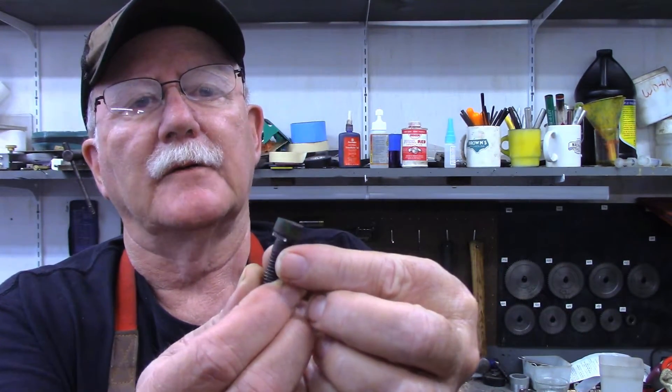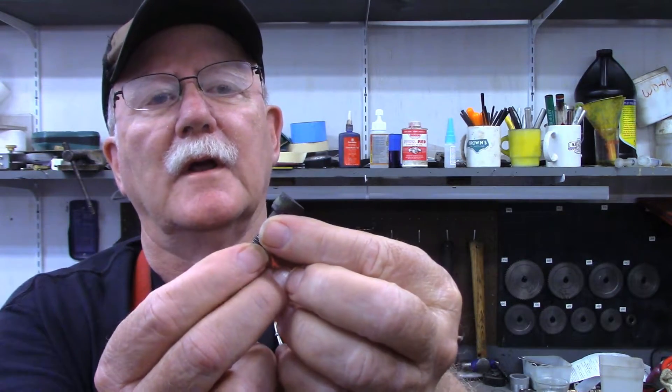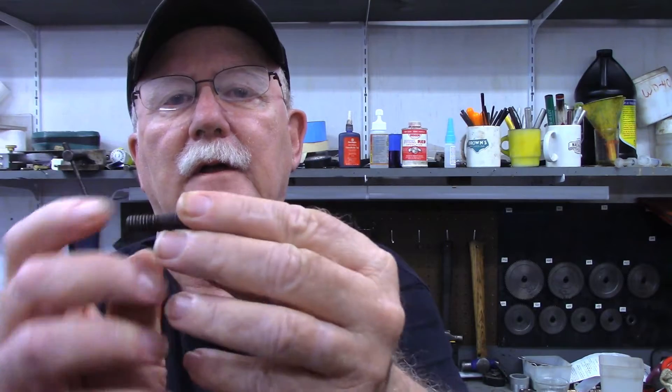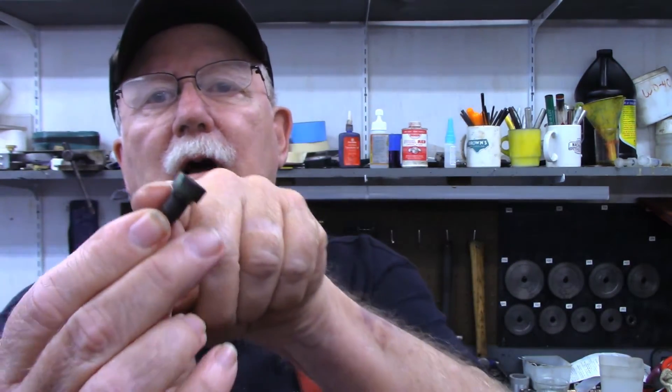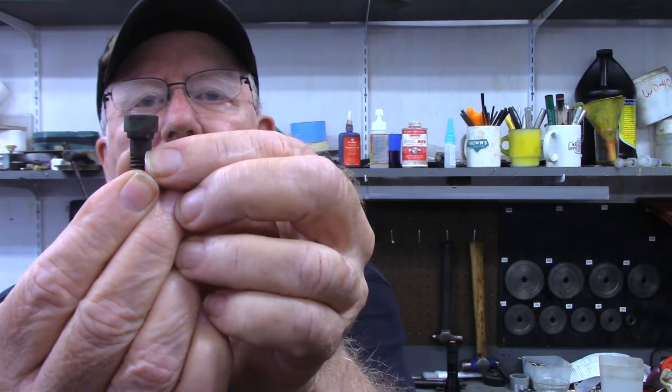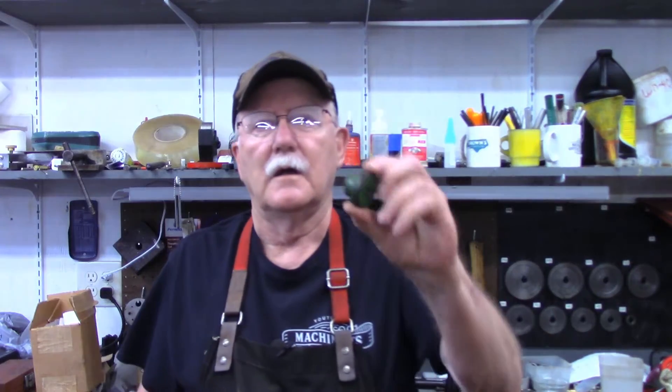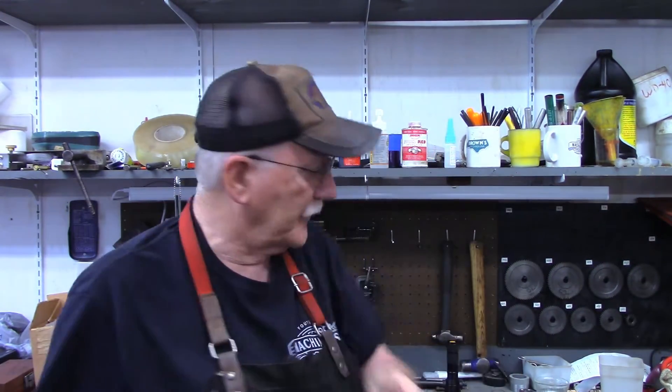If you note the paint on there you might get an idea of what piece of equipment it comes off of. This has a short threaded area, a short non-threaded area, double shoulders, and a half inch diameter head. We're going to make this out of half inch cold roll stock. It mates to another piece, and in the next video we'll make that piece and I'll show you what it goes to and how it's used. But today we're just going to concentrate on making this shoulder bolt. There's going to be a little bit of lathe work, a little bit of bench work, and a little bit of mill work. So let's turn to the lathe first.